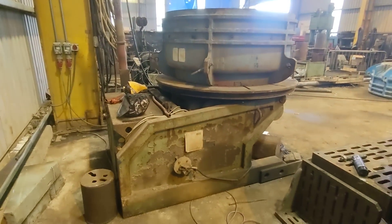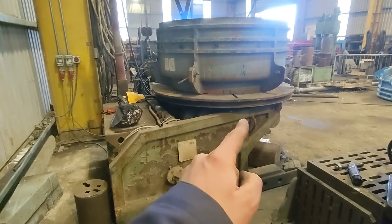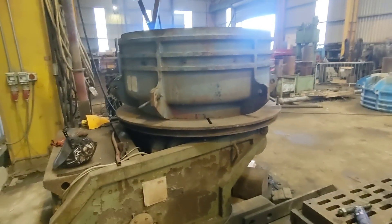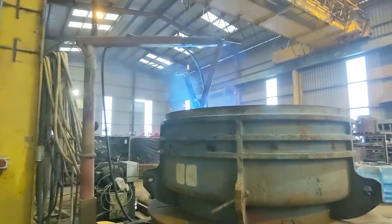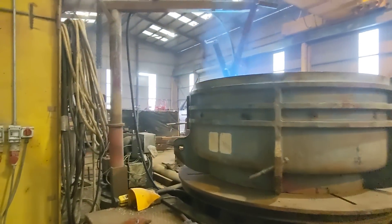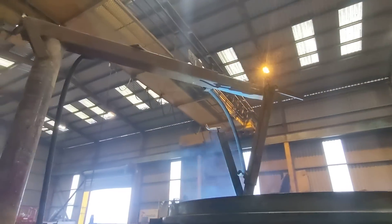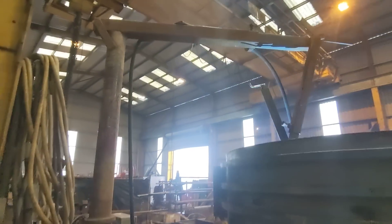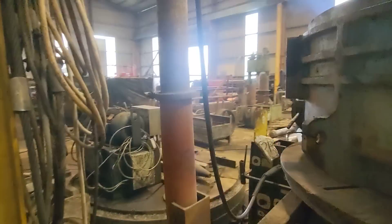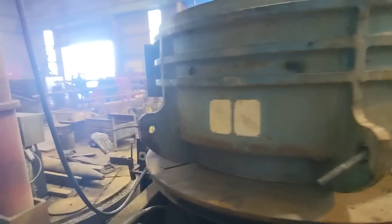What you're looking at is a large welding manipulator rotator. The table, as you can see, is very slowly rotating. That is the traveling of the weld, and what I done is I knocked together a very simple adjustable arm — it telescopes here and telescopes there, and it lifts and swings on this point here. Just some very simple brackets made with steel we had laying around in the scrap.